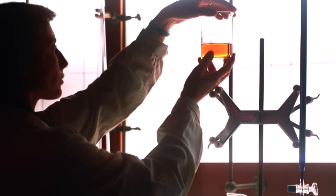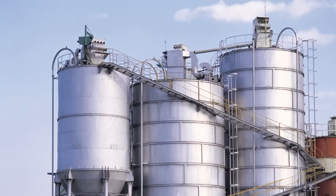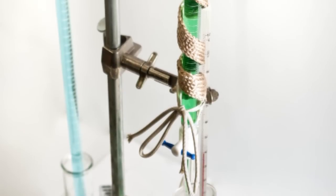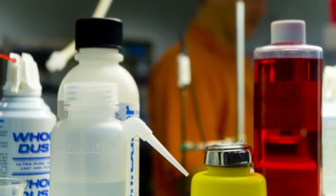Heating tapes offer many advantages for solving a wide range of gas, liquid, and solid heating applications. From controlling a process or the viscosity of a liquid to preventing condensation or protecting objects from freezing, heat tape can be used by almost any industry. The selection of your tape depends on the length, diameter, configuration of the surface to be heated, required temperature, required wattage, and environmental conditions, such as possible contact with moisture or chemicals.